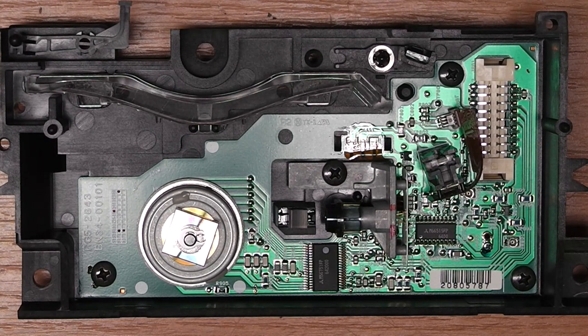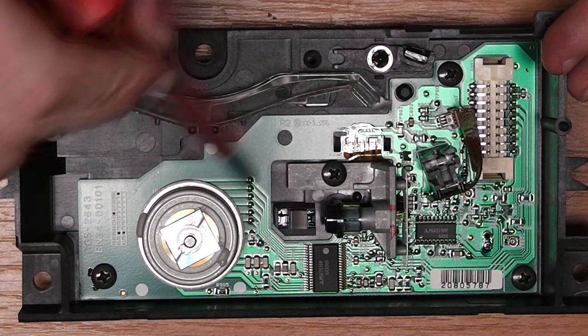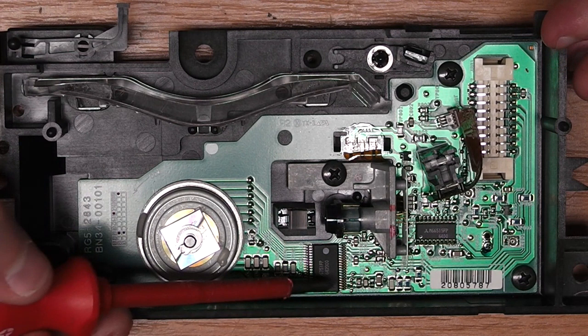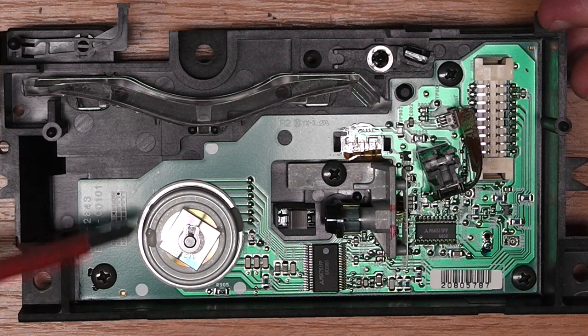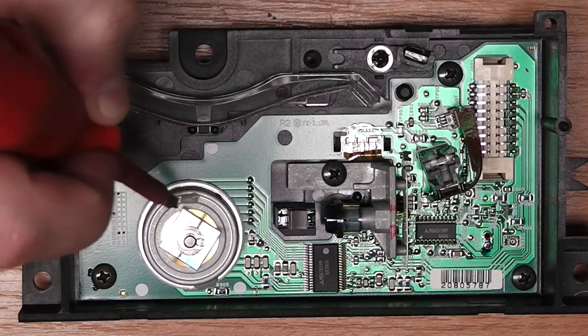On the whole other stuff here, again, as I mentioned, we have this rotating mirror which deflects the laser beam onto different pieces of the sheet of paper. This probably is a BLDC controller for the brushless motor that is actually running this here. And probably some Hall sensors somewhere so it can detect when it has finished a whole rotation, so it knows where the mirror is.